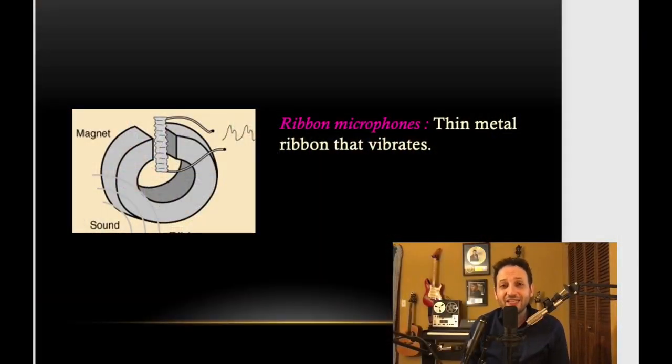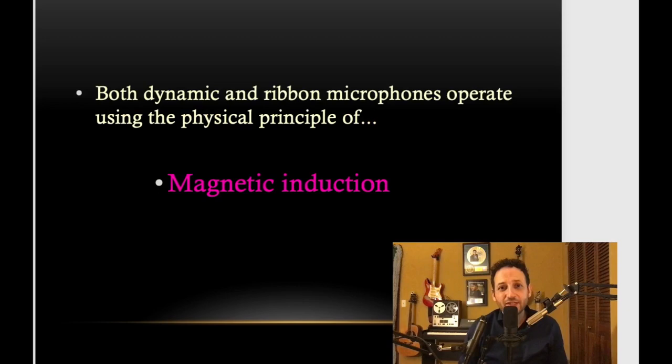Let's go to PowerPoint and check that out. Now you have a magnet, but instead of that coil of metal, we've got this ribbon — and it's so thin and very sensitive. We talked in our last video about how the ribbon microphone was one of the reasons the quality of our recordings changed, and when recording quality changed, the type of singers we recorded changed, because the ribbon was able to capture subtle fluctuations that the microphones of the day could not. The ribbon mic and the dynamic microphone both function on the same principle: magnetic induction — a magnet and something moving between its poles, and that's where the transducing happens, converting sound waves into electricity.